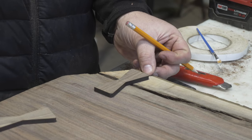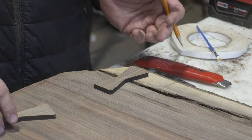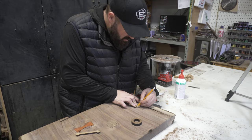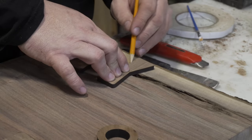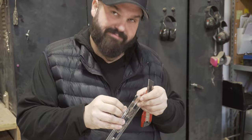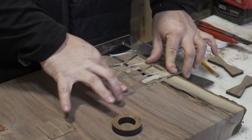I'm having to keep the center of my bow tie off of the center of my crack, just because I've only got a little bit of wood to work with out here on the edge. I don't want to blow out the end of the slab, so I have to offset it in just slightly. I'm marking the outside of my bow ties so that I can get proper alignment with my template.